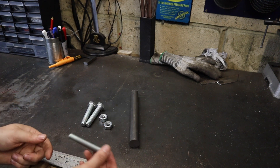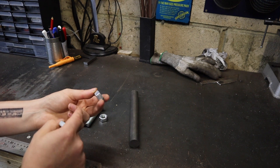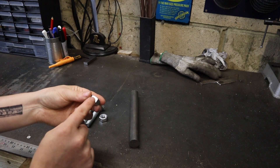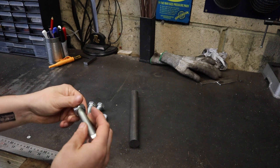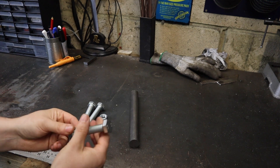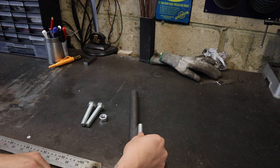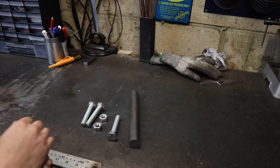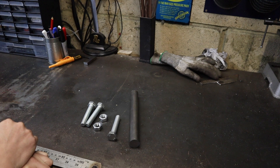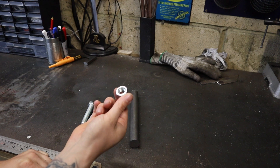My main thinking behind this is that the welded ones are only going to have about 10 millimeters of stock to hold the bolt in. So if they're taking any considerable weight, they won't be as strong as the tapped one, which will have a lot more threads to hold the weight. I'm going to start off by doing the simple dirty ones - cut these down, drill out the centers, and weld some nuts on.